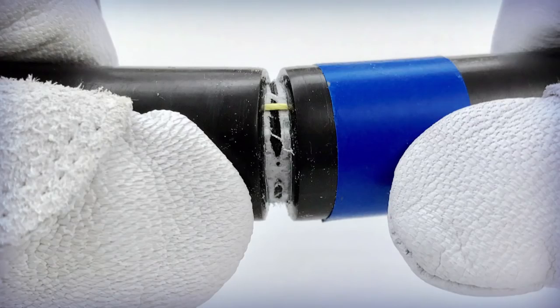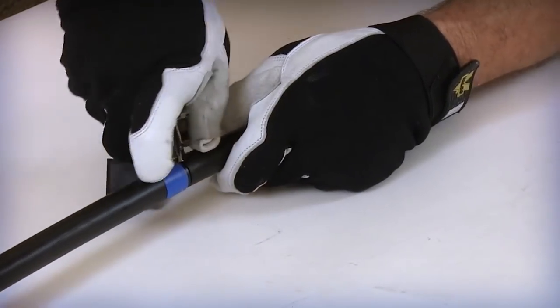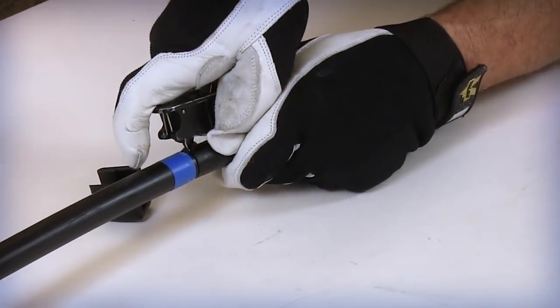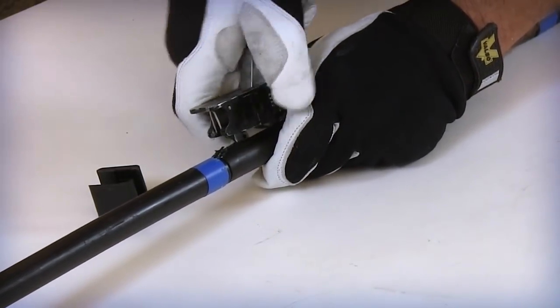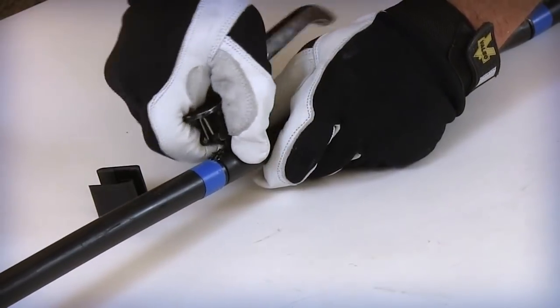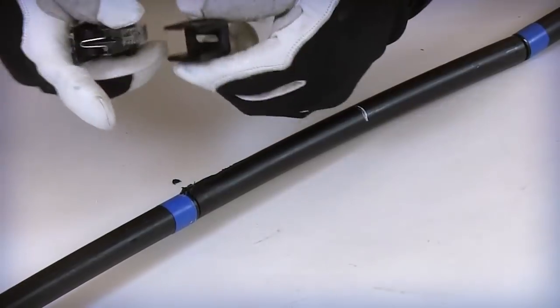Visually locate the cable's rip cords between the two jacket layers. Slightly bend the cable at the ring cut location and place the blade beneath the armor and away from the rip cords. Cut the jacket approximately 1 to 2 inches. Remove the armor entry tool and replace the cable guide cover.